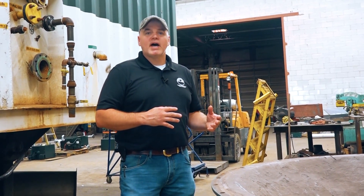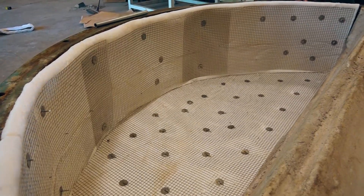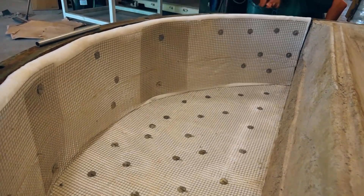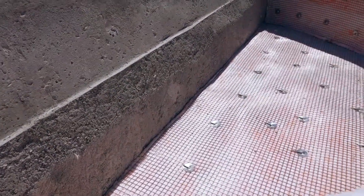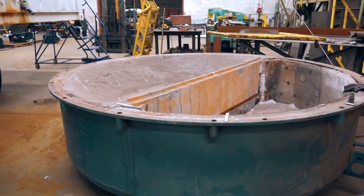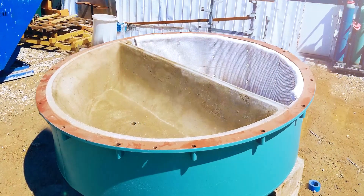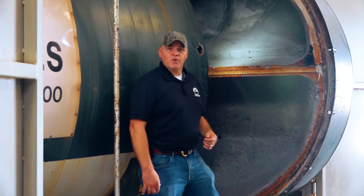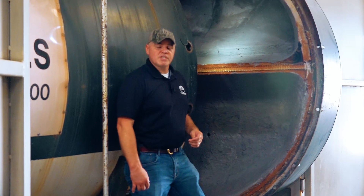In regards to insulation properties, the steam boiler's function is essentially to rapidly heat water, so retaining those valuable BTUs during and between the burner cycles is of utmost importance. The relation between the boiler's overall efficiency and its refractory cannot be emphasized enough. It could be easily compared to the insulation of a house — the better insulated a home is, the less the air handler or heat pump will have to work to retain a set temperature. Poor insulation means more cycles and premature wear and tear. Likewise, poor refractory on a boiler will decrease the boiler's ability to retain heat and transfer it into the water for steam production.